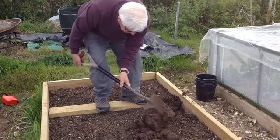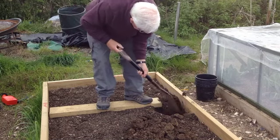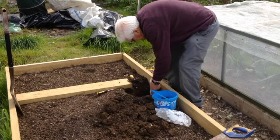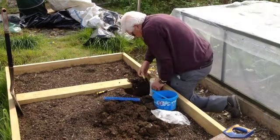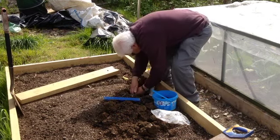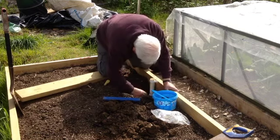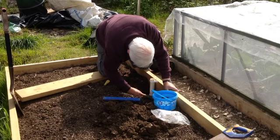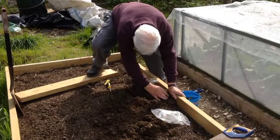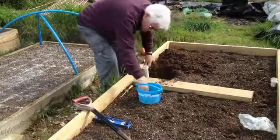The soil at these positions was just dug out, giving me enough room to screw some brackets and put in the tubes which are going to take the posts of the A-frames. It helps the process if this plastic post is plumb. This process was repeated 6 times.